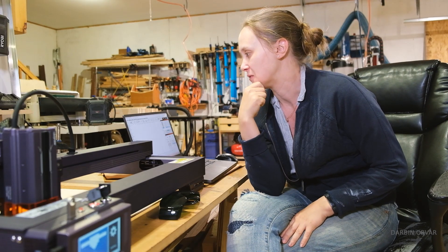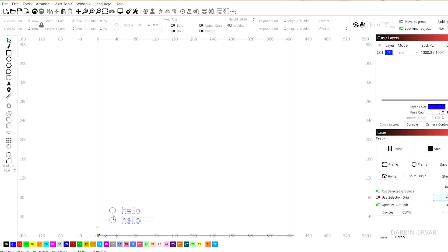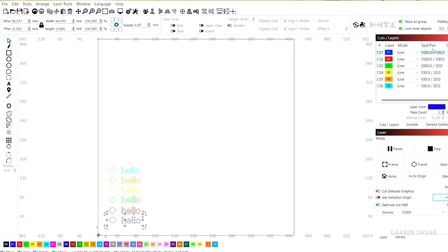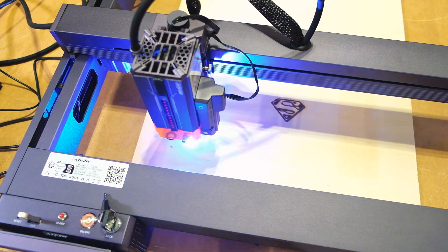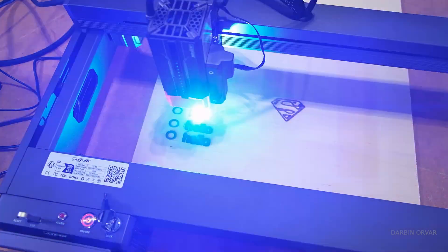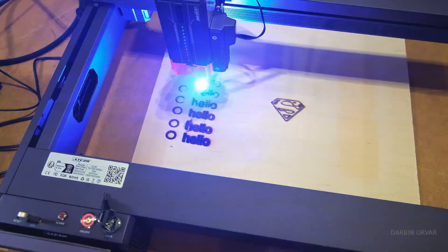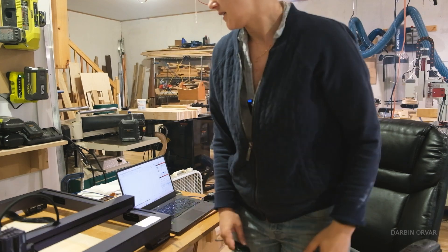What I think is pretty appealing about a laser engraver is that there's not much to it. It's about finding the right setting, but you don't have to think about securing your material the way you do with a CNC where there are such forces involved. I'm doing a test at 40 millimeters per second at 100% power. The percentage refers to how much power you're getting from the laser. Speed controls how fast the laser moves — faster means a shallower cut, slower means a deeper cut. I turned some fans on because it got a little smoky.